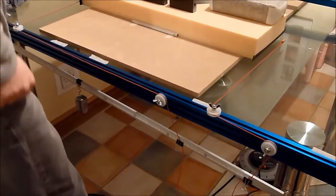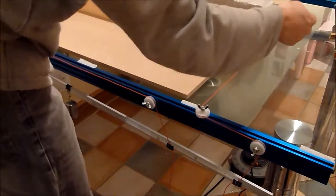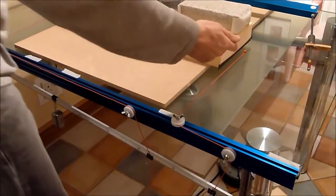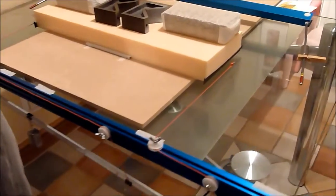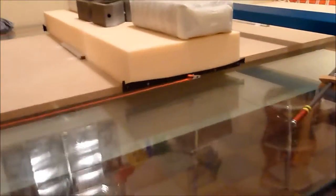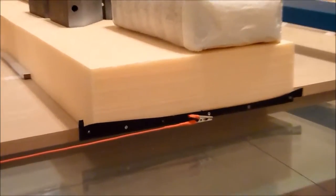All you're really looking for at this point is if there's a major discrepancy between how much the root is moving relative to the tip. So you want them to be moving at a rate that they're both going to come out at the same point. And they are, that's about 2 pieces away. Yeah, we look pretty much bang on. Let's say if this was a dead straight taper, both of these would be at 100%, because there is that little discrepancy in where it is.